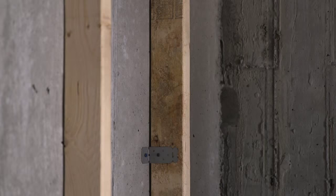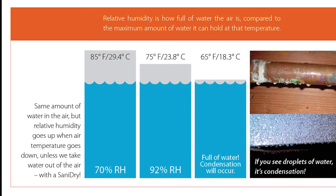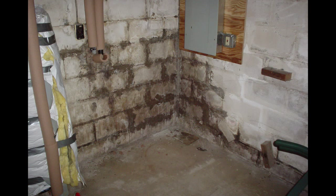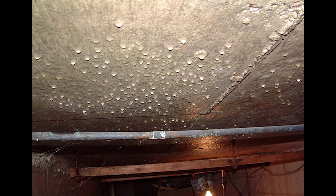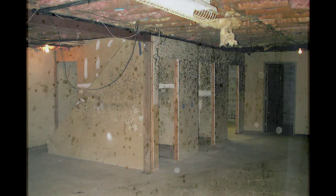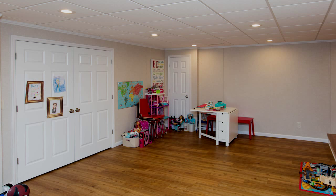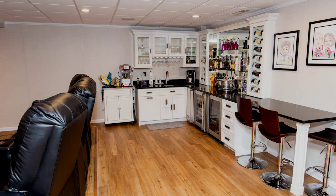Even if there is not a flooding event, basements have high relative humidity, particularly between the back of the wall and the foundation wall. This is because of water vapor diffusion through the porous concrete from the ground, and because it's cooler in this space. When we cool air by one degree Fahrenheit, we raise the relative humidity by 2.2 percent. When interior or exterior air gets into a basement and is cooled, the relative humidity goes above 65 percent — enough for mold to grow. You don't need a water leak for mold to grow, just damp air. When a basement develops a musty smell, that smell is the airborne seeds of growing mold — just what people with allergies and asthma react to. By using Total Basement Finishing, no organic materials are used in your basement and mold cannot grow on your walls or floor, and you will not have to replace them when you have a temporary flood or leak.